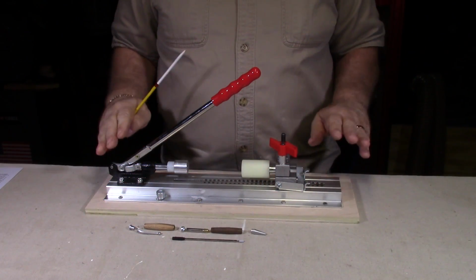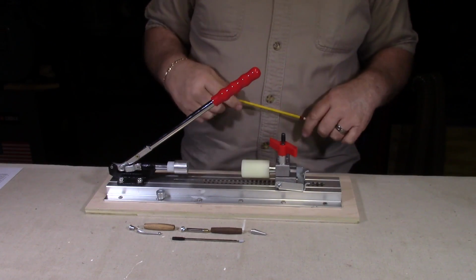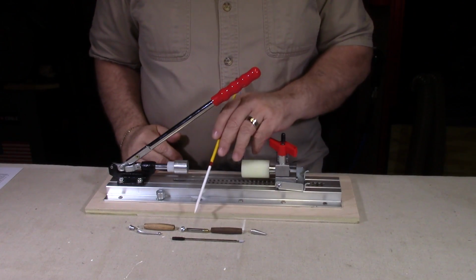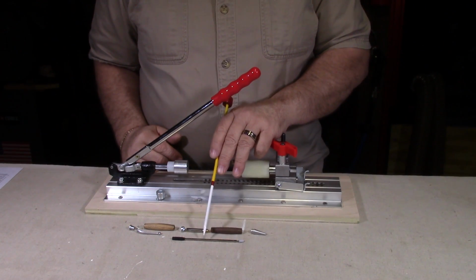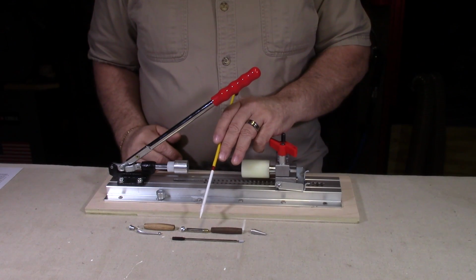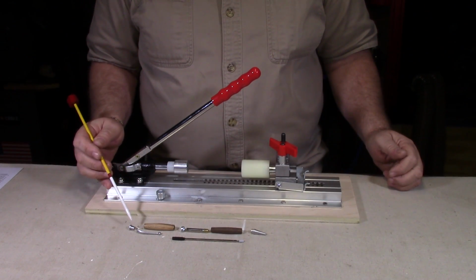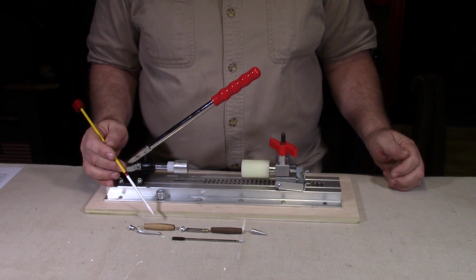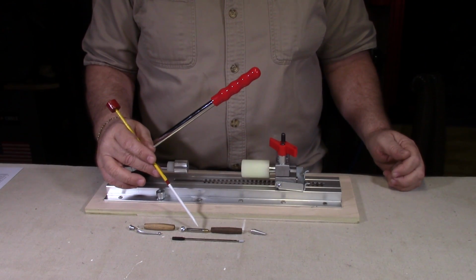Okay, we have our pen assembly press here, ready to put all these parts together. What we start out with is pressing the pen tip in to the body, then the transmission into the body. The transmission is what will hold the ink refill. Then after that, we just slip this middle ring on. Then we'll press this cap and the pocket clip into this upper body, and then these two pieces press together onto this transmission part.